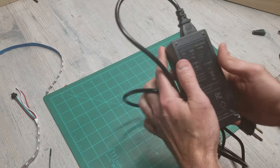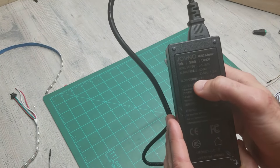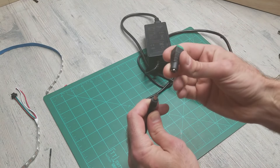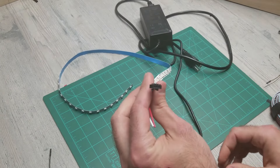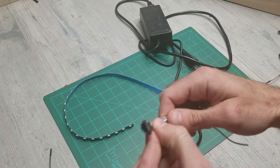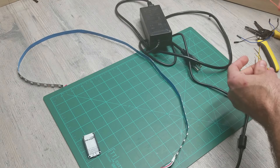This project has a lot of LEDs, so I'm using a 5-volt 15-amp power supply, which comes with a barrel adapter where you can plug the LED wires directly in. To get everything wired up I'll be using the beginning piece that most LED strips come with. If you don't have that, you just solder some wires onto that beginning strip.